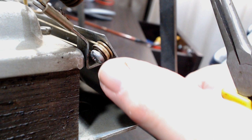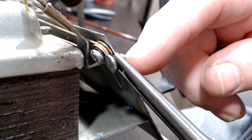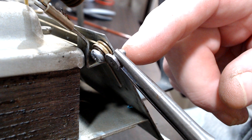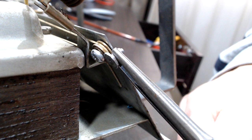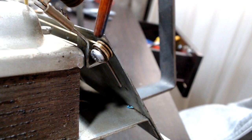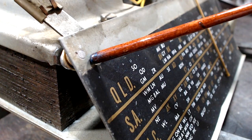The cameras are off and I've been working on this pulley for quite a while trying to free it up and couldn't get it to spin freely. I ended up drilling out the original little stud — the axle. From the factory they riveted it so hard that the little pulley couldn't spin on the axle at all. No amount of lubrication was ever going to free that up. So I drilled it out and fabricated a new one from a screw, machined down to fit through the hole and riveted over. It's now working nicely — the tuning is really smooth and easy.